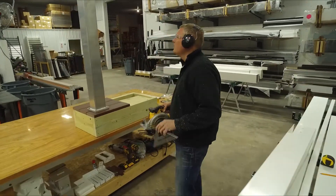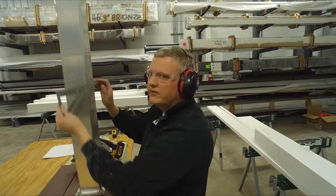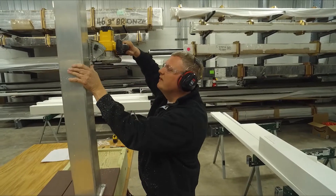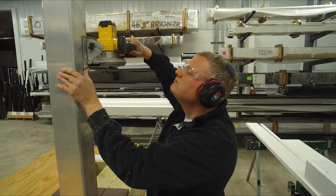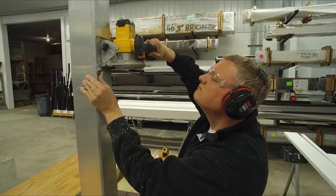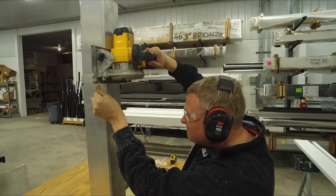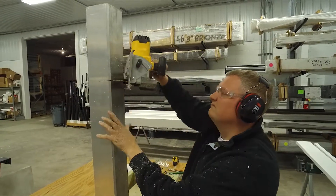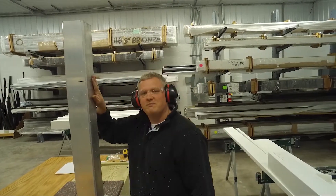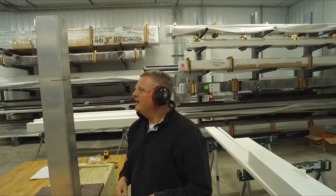The last item to demonstrate is our aluminum post mount. Same drill — measure and mark with your speed square on all four sides of the post. Hold up your saw and very carefully and slowly cut that aluminum on all four sides. Now if it's hard to get a perfect cut on this step, don't worry too much about that — the vinyl post sleeve, once it goes over this tube, is going to cover up that cut. On to the next step.